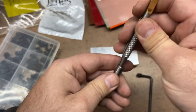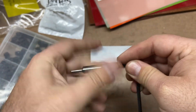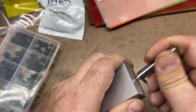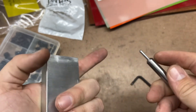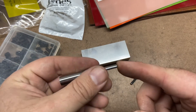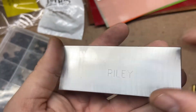Assembly is just as easy as disassembly: stick it in there, pop the spring in — it's a 0.240-inch OD spring so there's plenty of room — then put your set screw in and you're good to go. You'll want to break it in a little on a piece of scrap to smooth any burrs on your shaft or inside the bore and make sure it's not hanging up anywhere. A little drop of oil or grease may not be the worst thing either. As long as everything is centered so you have minimum runout on your point, you should get pretty good results.